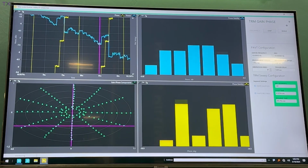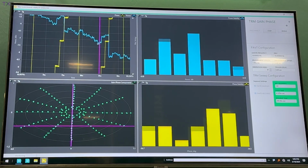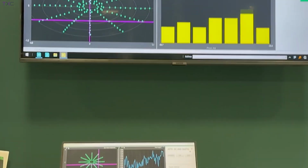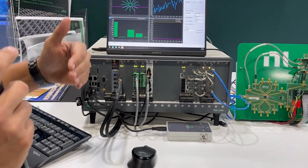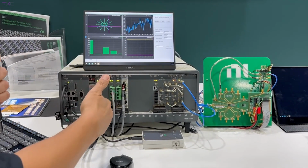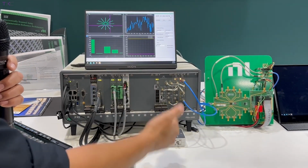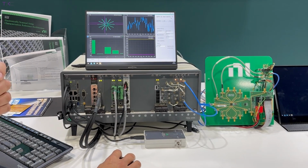The last part to note is that within the system here, because we've got time domain, frequency domain from the VNA, and digital control, we can go full coordination where there's no real software commanding and controlling of the individual instruments. We've told the digital instrument, here are all the commands we want you to send to move between each one of those positions. Analog instrumentation, every time you get a signal from your digital device, take a measurement. The digital device is waiting for the last sample to be acquired, even before we're through processing it, telling the digital device to move to the next location in the array that you see here.